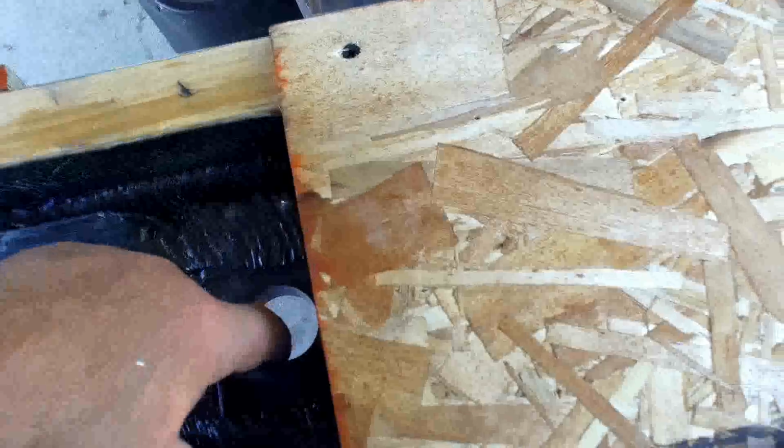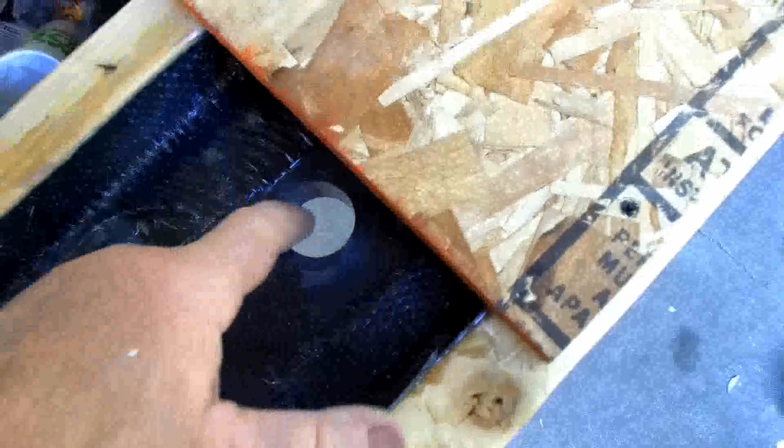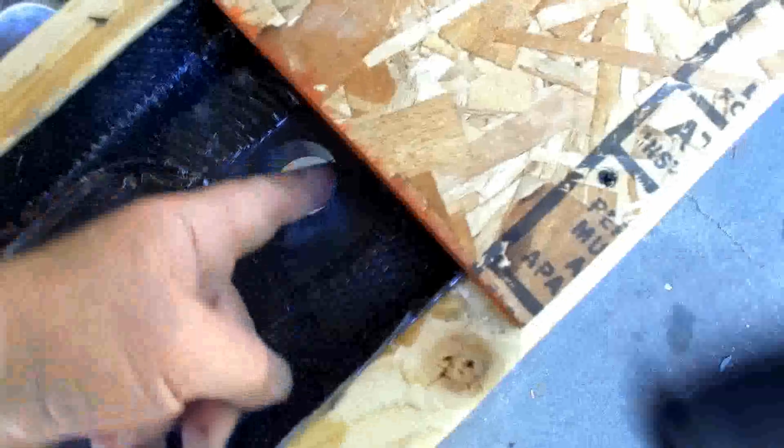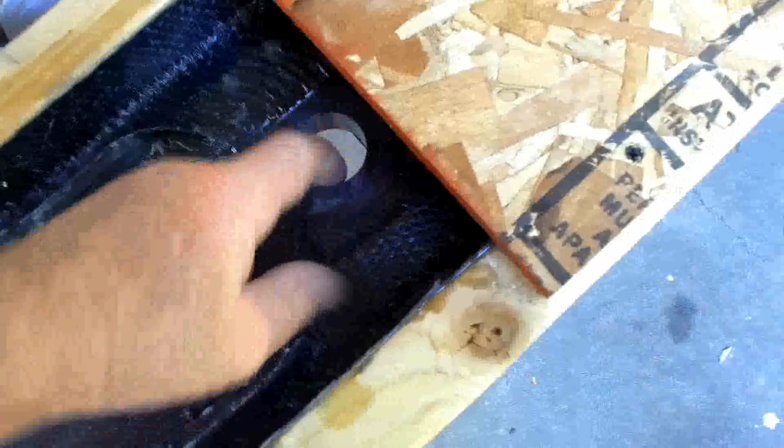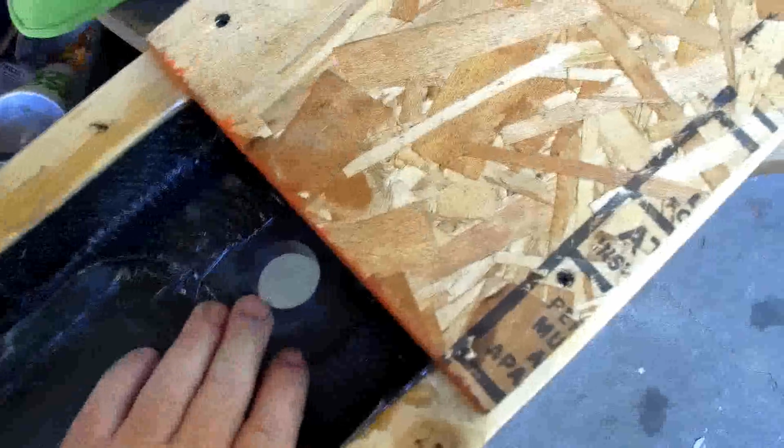This fitting here, the 1/4 inch thick wall carbon fiber tube that takes the steel tubing pin that goes through here, this is intended for the final design wing attachment, and this worked perfectly. It has no ovaling, it has no dents, it's exactly the same as when we started the test. It suffered no damage or deformation whatsoever. I think this design is solid, good to go for the final aircraft.